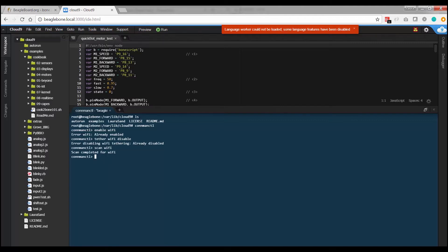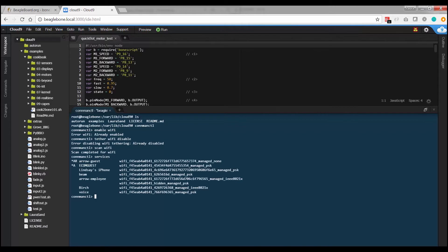Then scan for Wi-Fi networks and type 'services' to display the networks you have access to. In the next step you will need to enter that entire 'wifi_underscore_gibberish' string, but it will stay on your screen so don't worry too hard — just be aware of which one you actually need to connect to. Once you've found what you need, type 'agent on' to get ready to set up. Once agent is on, type 'connect' and then the wifi_ string for everything you see above. If you use Tab, it'll auto-populate until the next step where something differs. Hit Enter and if this is a password-protected network it will ask for the password. I've already connected to this one so it already knows it. You are now connected to the internet — we think. Type 'quit' to get out of ConnMan.